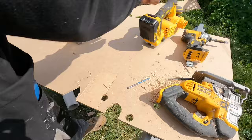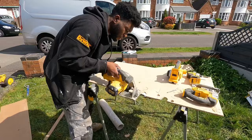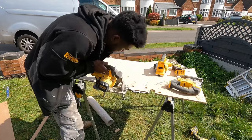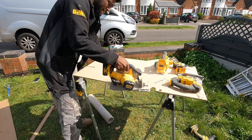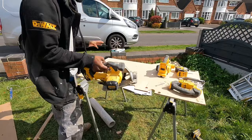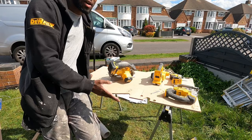The final basic tool: if you haven't got a hand saw it's always best to use a circular saw. Set the depth to what you're cutting through — it saves the blade and makes it easier to cut. For straight cuts just make your mark, cut down, and it's very straight. It works just like a hand saw but a bit faster, and it's a great way to cut sheet materials down.